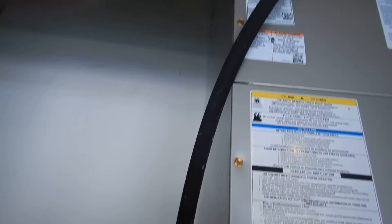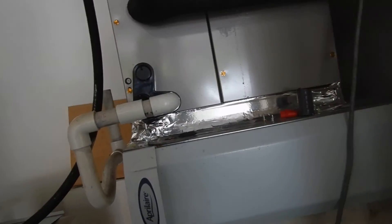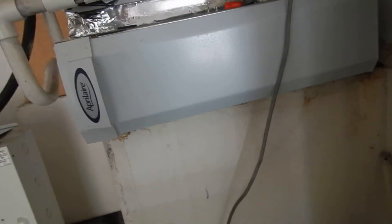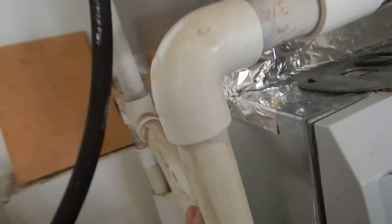When it's off, you know it can go in reverse. So we learned that we've got a leaky air plenum, unknown air filter size, no secondary drain line, no safety switch, shallow P-trap, no insulation, and no care and use manual.